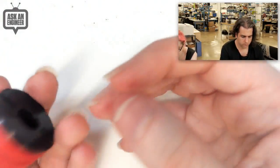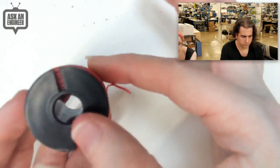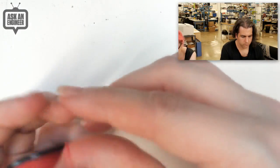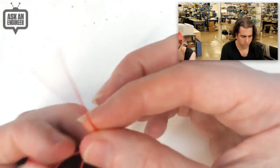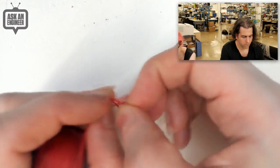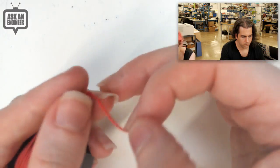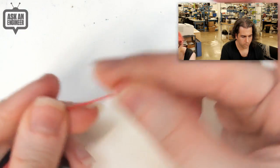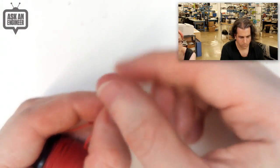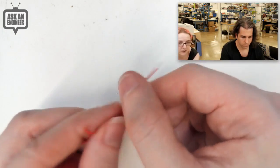It's 50 feet per spool — kind of standard spool size, but they're little thimble-sized spools of wire. What's really nice about them is, one, they're incredibly flexible. They're much more flexible than PVC coated wire, which tends to crack a little bit. So these are very flexible and dynamic. And when you solder them, they solder very well — the silicone coating doesn't shrink away.